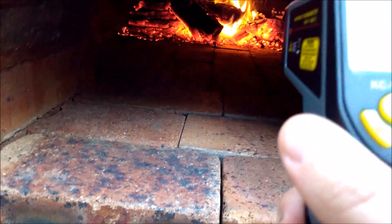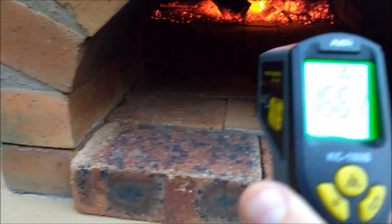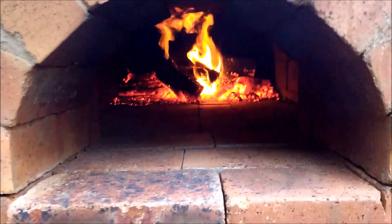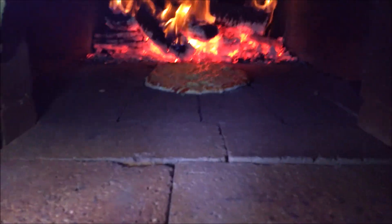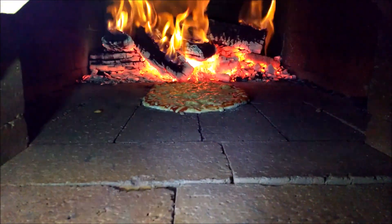I found when using the oven that while there's a lot of heat up top, it tends to lose a lot of heat through the base. The bricks are directly in contact with the concrete top of the table, and it seems to suck quite a lot of heat out of the oven. So what I ended up doing — you can't see it in these photos or videos — was using some calcium silicate board, 20mm thick, just to put a layer of that underneath those bricks. That's improved the performance of the oven quite a lot.